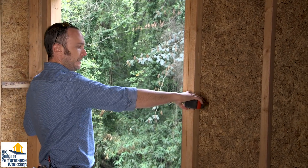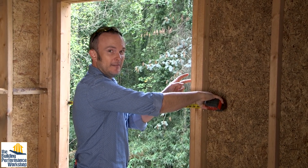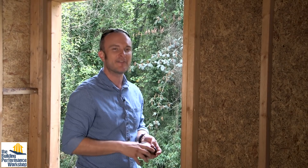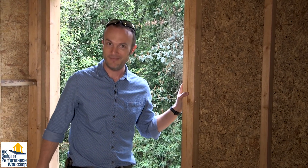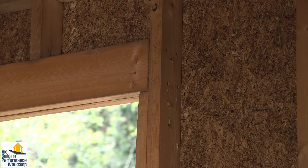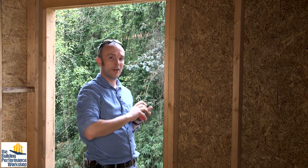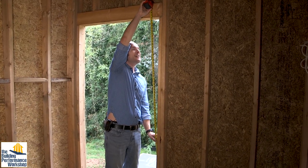What we have here is 38 inches, which is perfect if I didn't have a buck. What I can do is take this entire framing member out — it was cut back to make it 38. Taking the whole thing out entirely gives me 39 and a quarter, which is fine if you have a little more than you need. You just shim and add some insulation — try not to stuff it too hard because air is the main ingredient in insulation. When we take this out, it's called the jack stud. A lot of people will say no because its job is to hold up the header, but if you talk to a structural engineer — which I do weekly — we put three lag screws through the king and into the header, and the house won't know any different.